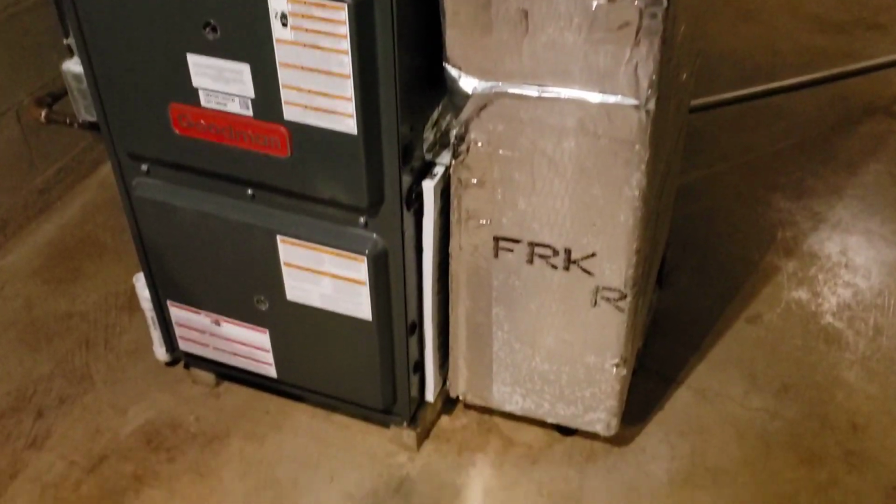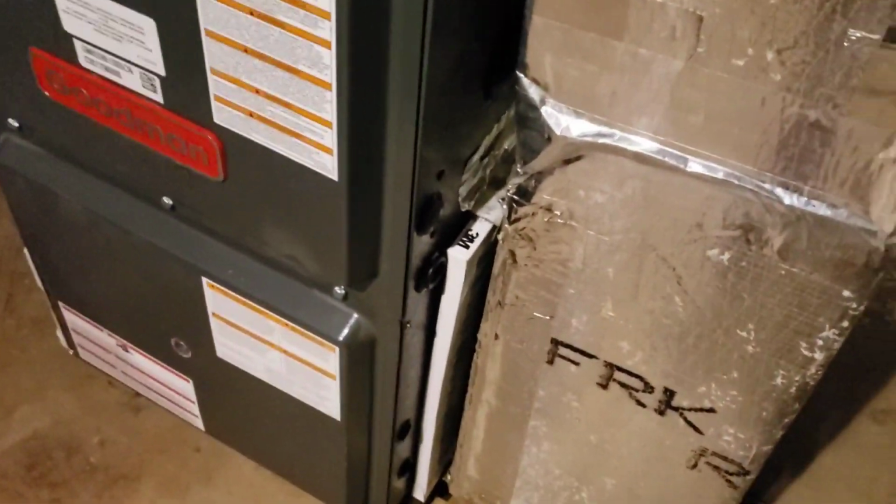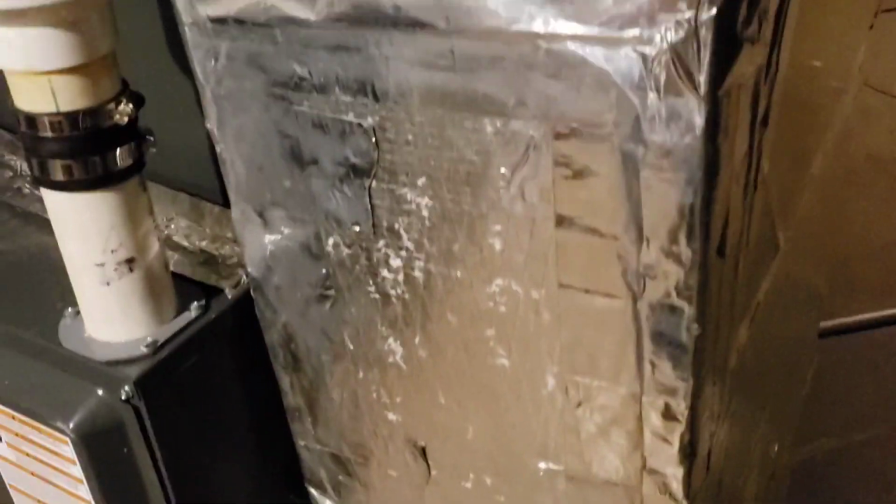All right, here's the furnace. As you can see, the filter down here, that is the cold air return plenum for the ductwork. And this piece had been patched before, so we already have metal pieced into this fiberboard. Got a nice big area. That should shine through this cold air return duct, and actually it should catch even part of the filter. So that's a good place. I found my mounting location. So let me go modify my template and get this cut out.